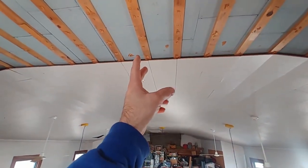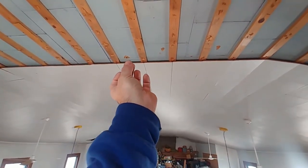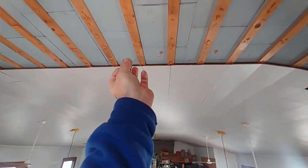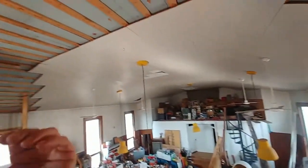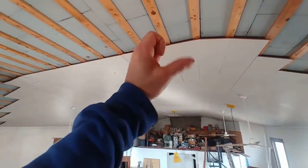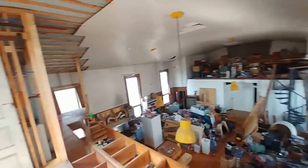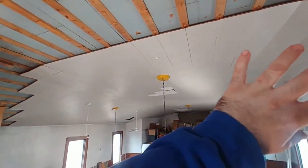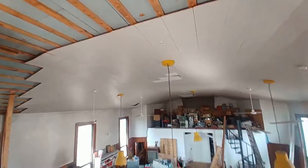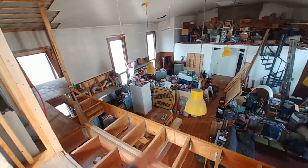We'll start with two, maybe one in the middle, and we'll go right through the top plate of the wall and right on up through the space between the furring strip and through that old ceiling, and we'll get right into that block and pull that top plate up snug and sandwich all of this stuff. But we'll be right on the 2x8 construction of the rafters upstairs. And that'll allow us to save cutting anything out as well as gain all of the appropriately rigid attachment to help support. It's everything we can do to support the leading edge of this.